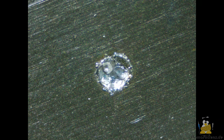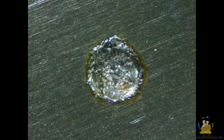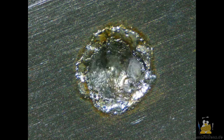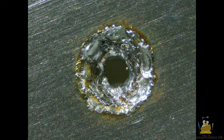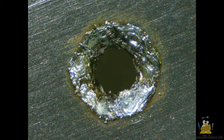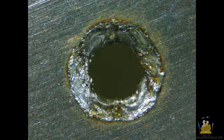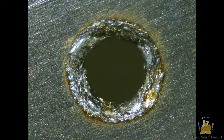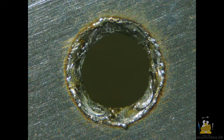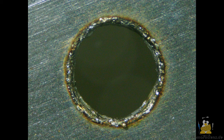What is still missing is drilling through a 0.5mm plate, which is 5 times thicker than the razor plate that has been drilled through so far. This deep drilling is extremely accelerated by the liquid flushing. While most of the molten metal had solidified again and again in the drill hole without being flushed, it is now efficiently removed from the hole by the liquid flow. The formation of cracks due to this constant melting and solidifying can no longer be observed. In addition to transporting away the eroded metal, the cooling effect of the water also leads to better results. Instead of the original 7617 shots, the bore is now completed after only 530 shots. Now it works out that for a 5 times deeper bore, only 5 times the time is needed.